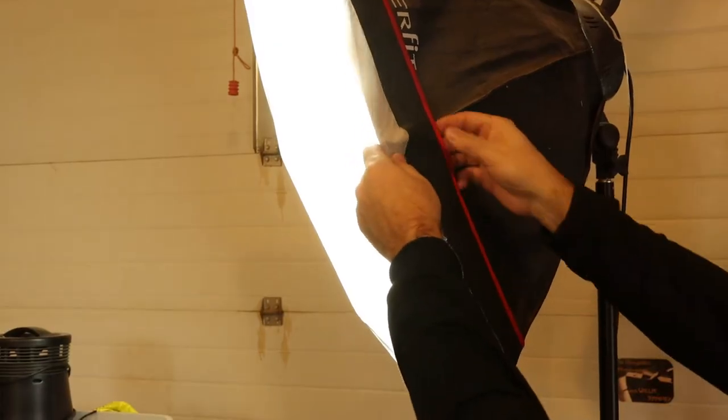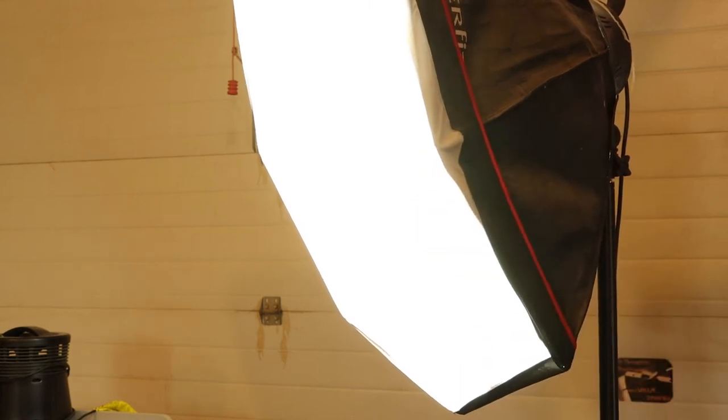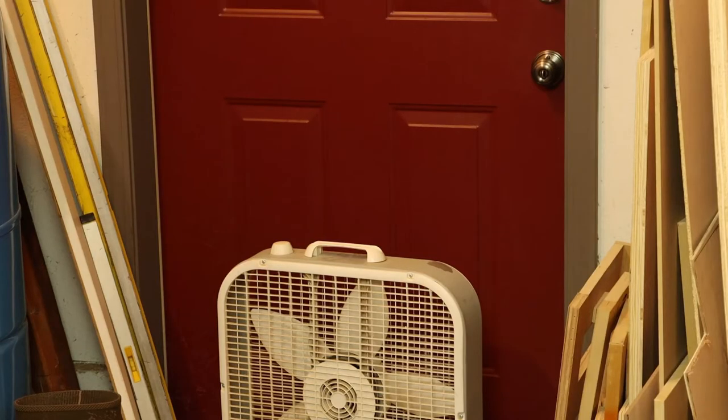You'll want a bunch of lights positioned around the shop and put them at kind of a low raking angle. That'll highlight the finish as it goes on. You can't do a good job spraying if you can't see your work. If you only get one thing right about spray finishing, make it this: work in a well-ventilated area. I've always got a side man door open with fan running, plus a main garage bay open to spray.